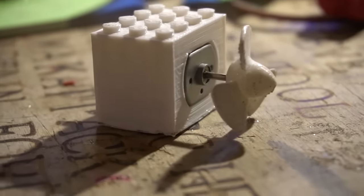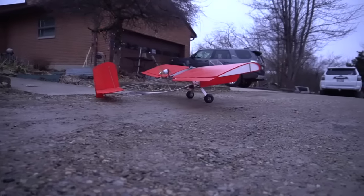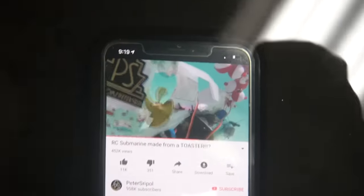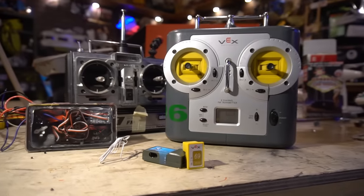Some of the motors were interfaced into 3D printed parts that Sam actually designed. The interesting challenge with submarines is command and control. Most modern RC aircraft and vehicles such as drones and airplanes use 2.4 GHz for control, however they don't exactly work underwater. If you get yourself an iPhone or any phone and have a waterproof case, try to load a YouTube video and dunk it in a tank of water. What you'll quickly notice is that the signal will drop out in probably around 3 to 4 inches. It turns out your phone operates on 2.4 GHz and sometimes 5.8, and when you put it in the water it doesn't go very far, which is why we had to switch to lower frequencies such as 75 MHz or even lower to get something that works underwater.